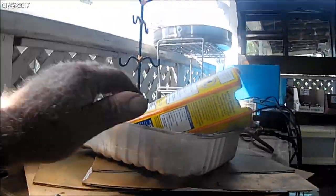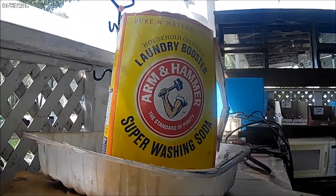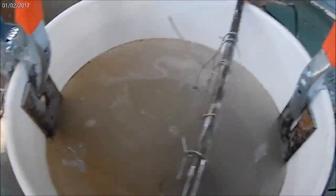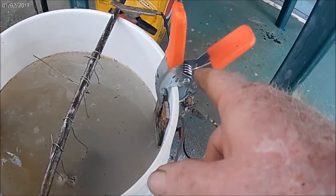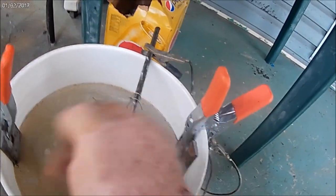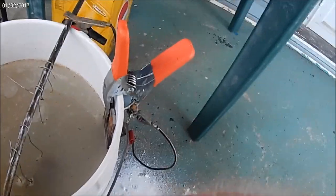First of all I've got some of this — everybody uses it and it's readily available, not harmful. Then we've got this in here and we've got, well, I'll run off that little battery charger right there. It needs to be one of the older kind — not one of the smart chargers, because it won't work unless you run through a battery first. Back to this: we've got our negative one here, positive over here on these things, and that's what's going to pull the rust off of what we're trying to clean onto these — I don't know what they call them, anodes or something like that.